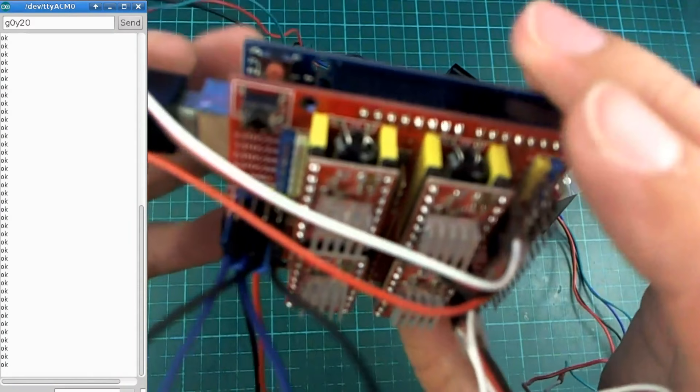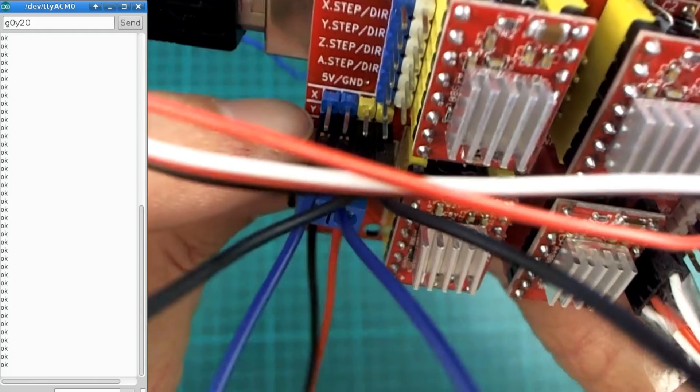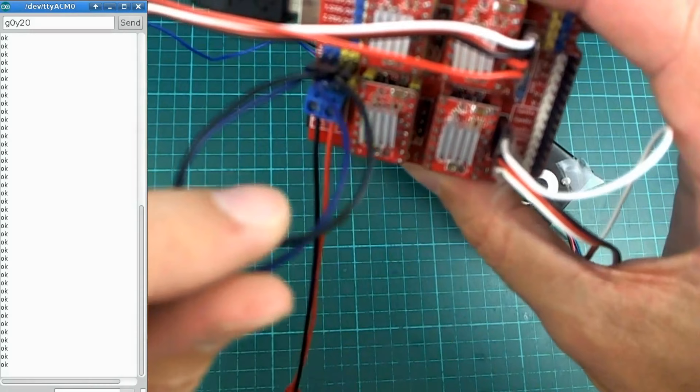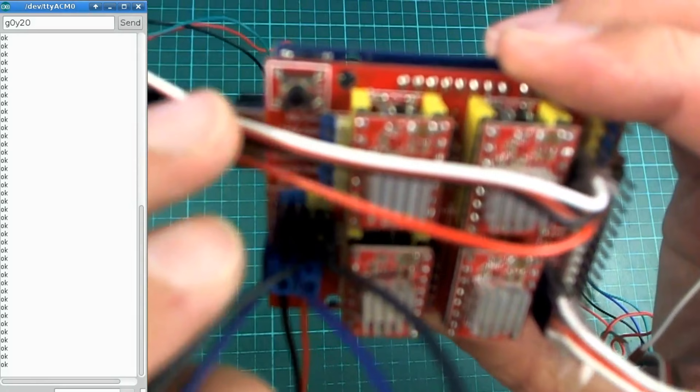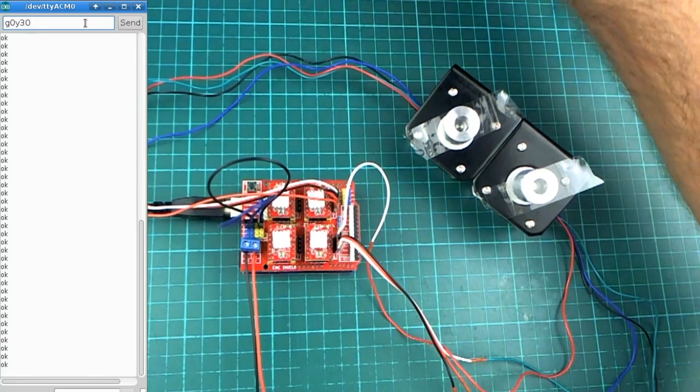Okay so that's all hooked up now, seems to be working alright. As I mentioned in one of my earlier videos, to clone one of the axes to the A axis you need to connect these jumpers on the left hand side here. You can see the second row is Y axis, and I've just put a couple of long wires to connect those — I could even just put a little solder bridge across them. If I try this you'll see that they move in unison.